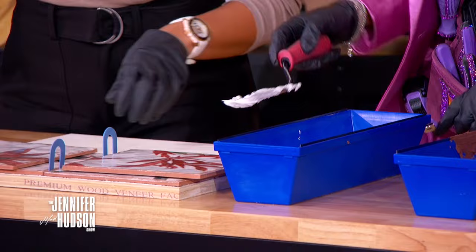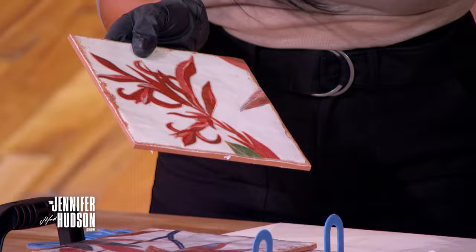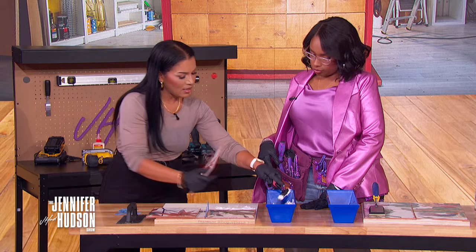What we don't want to do is make it flat. You see these grooves right here? The same grooves are on the back of this tile. It's a handmade, hand-painted tile, and we don't want to make it flat because it won't pick up on the grooves on the back of the tile. So you just kind of want to make an S like that — pick up a nice bunch of it and make it in an S form.